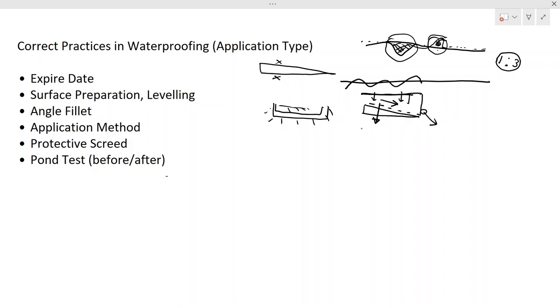Through the cracks. So if you have a main structure like this, if this is cracked, water will penetrate into the structure. Then in the presence of oxygen, since moisture has already penetrated, the reinforcement will corrode. So we have to protect the structure. One purpose is protecting the structure from the penetration of water through the cracks. One of the most important things we are doing is waterproofing.